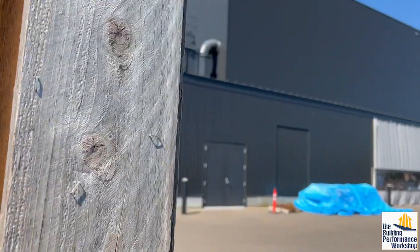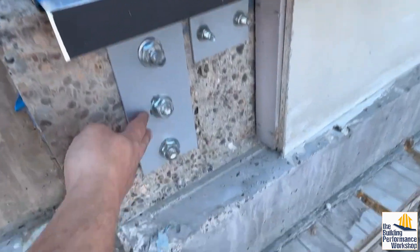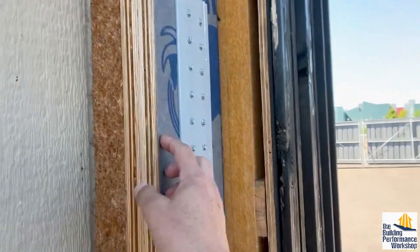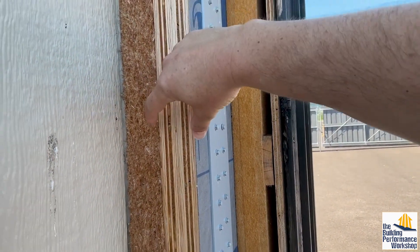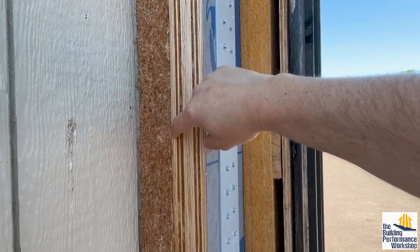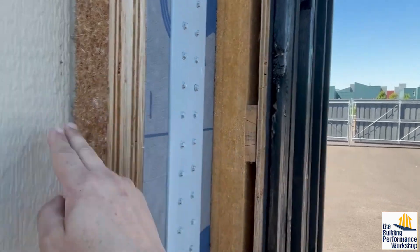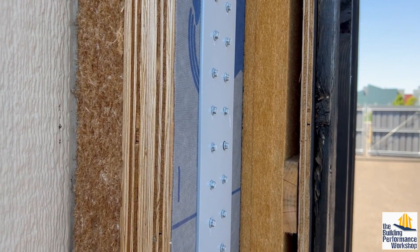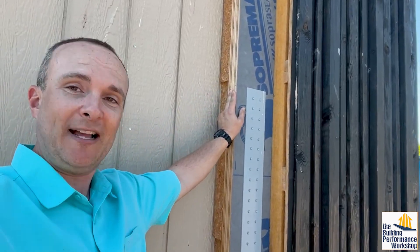What they've done is attach to it something that goes down and attaches to the foundation wall, then comes up and is binding this 2-inch thick plywood sheet. This is called mass plywood panels — MPP. Inside of that is exterior insulation, and outside of it is more exterior insulation. Both of these are made of wood. These screws don't attach to the house structure at all — they just attach to the mass plywood panel, which is strong enough that they've basically built an entire exoskeleton around this house.